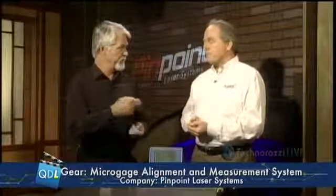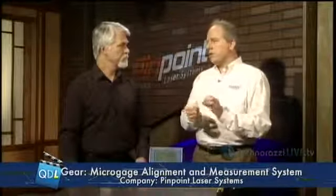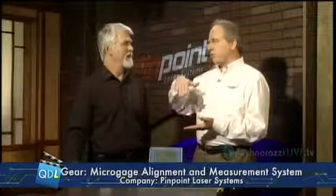How would they have done this in the past, not using a laser system? What would have been the old way of doing this? That's a great question. Typically, customers in the past have used piano wire, fishing cord. They've pulled it between machines. And then they just measure between the wire and their surface to get offsets and so forth? Exactly. With a ruler, it's effective, but fairly, you get 3 or 4 people making that measurement, you're going to get different answers. And of course, time-consuming too as well. Time-consuming and wire sags, string sags.